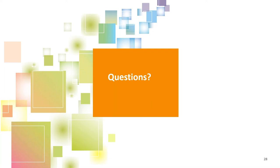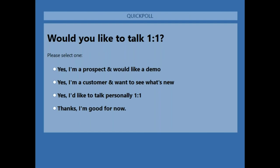Thank you, Jay. I see a few questions coming in — feel free to submit them now. One question is: is there any advantage in using the Plus with the larger aperture for monitor calibration, or should you just stick with the standard? On a standard monitor they measure very similarly and consistently. There are some large format displays used in retail with very large pixel pitches where you'd get a better homogenized reading with the Plus. But my recommendation for normal monitors would be to save the money and just get the standard aperture device.